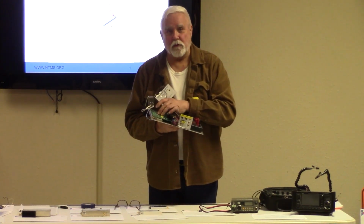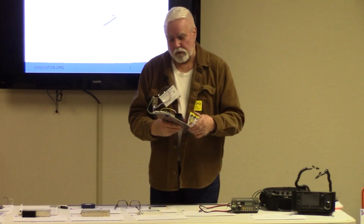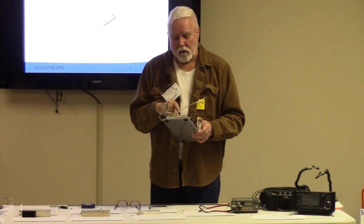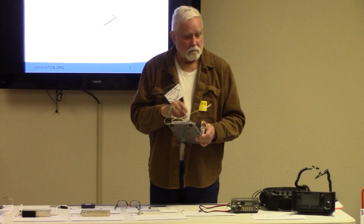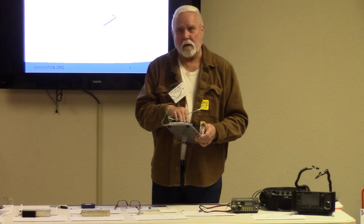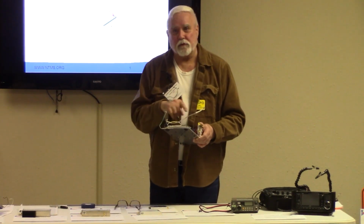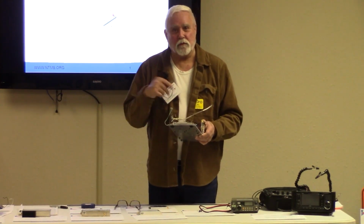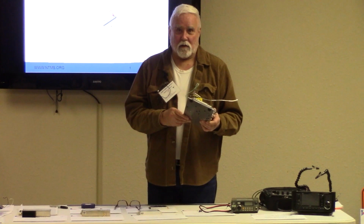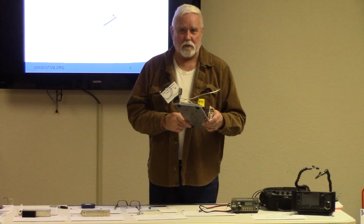Well, another Polish guy came up with this control board, the green printed circuit board, and designed it with synthesizers, i.e. frequency generators, that took a 10 meg stable signal and a PIC on there, an ATtiny85, that could be programmed with Arduino code, and it would inject both of those synthesizers to arrive at the right frequencies to put this thing on the ham band of 24 gigahertz. So we got involved with this as a club, and now we've ended up with 150 of these that we have sent all over the world.